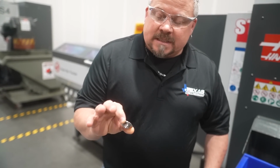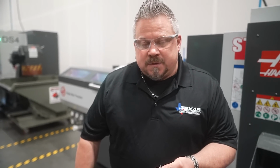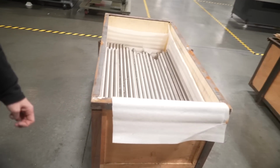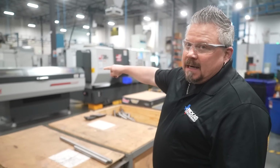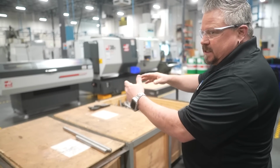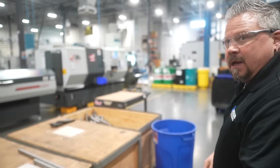And these go on every single one of our PRC cylinder heads. Any cylinder head we service or port here, when you get updated springs, or buy one of our PRC heads, these are the retainers we put on. And this is the raw material. That's some good stuff right there. Each one of those machines has that bar feeder on the back. We load that thing up with a bunch of bars. And once the machine eats a whole bar up and makes all those parts, it loads another bar into the machine, so it can run unmanned for several hours.